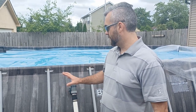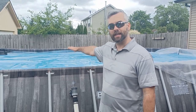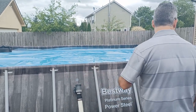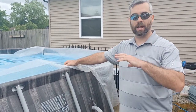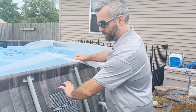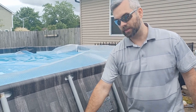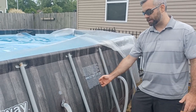One of the dislikes is this type of pool setup doesn't have a skimmer basket, which means all the leaves and stuff that get on the surface stay on the surface until they waterlog and sink to the bottom and rot. With a skimmer system, it would be over here. You can actually buy these, and if I remember, I'll put a link on there. I've never used one, so do this at your own risk. You cut a hole at the water level, and you install a skimmer basket, and you hook the outlet to the bottom of the skimmer basket.